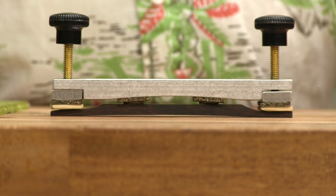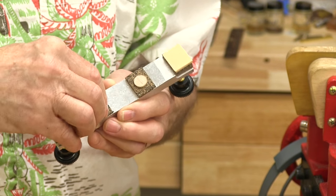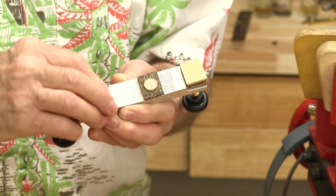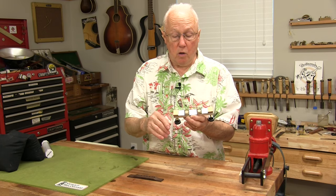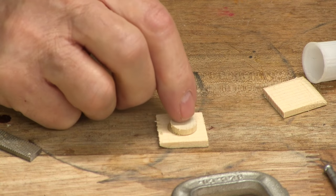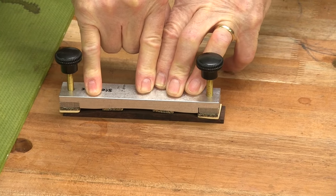My modification is pretty easy. I took a half-inch wood dowel and cut little sections off the end so they fit inside the holes in the cork pads that come with the clamp. These dowels are cut a little taller than the cork so they meet the bridge top first and fill that space between the caul and the bridge. Two others have the dowel cut to the thickness of the cork and glued to a scrap of wood, then shaped with a curve so they sit right down into the bridge wings. Now I have four really good contact points to clamp this bridge.